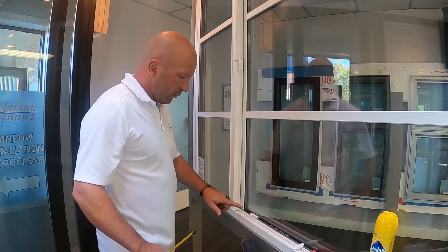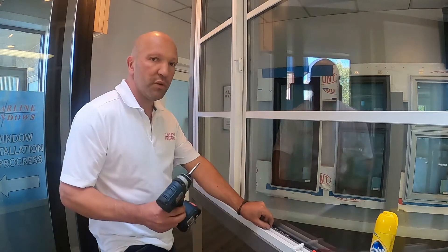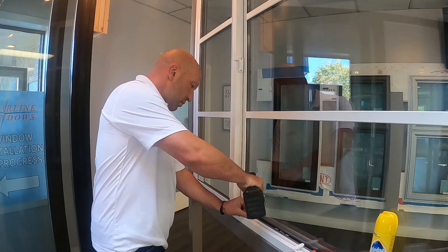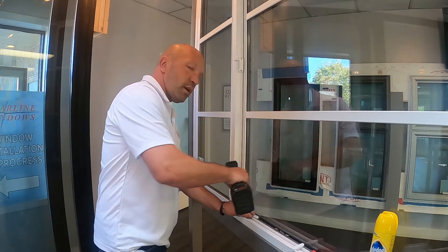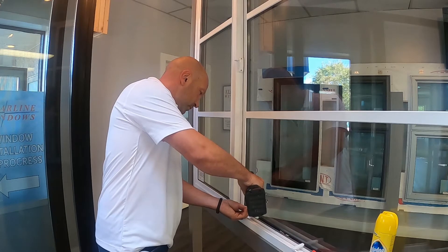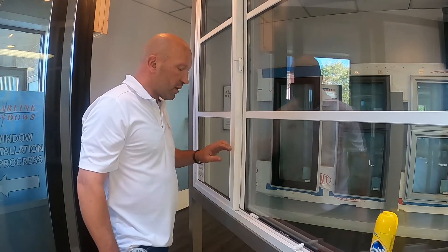I'm going to close the vent and we've got that vent restrictor situated perfectly on that little ledge of the window. You're going to grab your cordless drill with the number 10 Robertson and then quickly put that into the vinyl — be sure not to over strip it. You've got your two little fasteners, and as you can see that will actually restrict the operating of your vent.